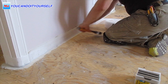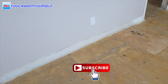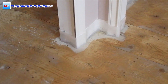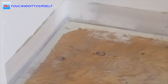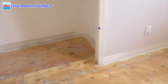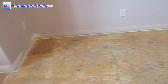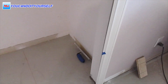For this 450 square feet I spent 28 bags of self-leveling compound — some spots were so deep. I want to explain one more time why I use foam tape around the wall: it gives an expansion gap between the wall and the subfloor. I also put caulk on the bottom of the foam to protect from leaks downstairs.